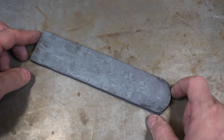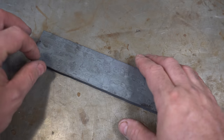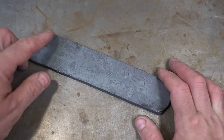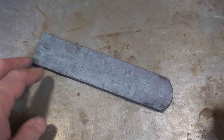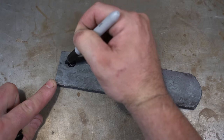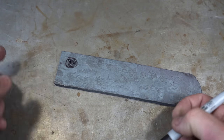Raindrop Damascus is another subtractive pattern, meaning we're going to be removing some of the steel from the billet so that when we repress it, the layers where it gets removed will get pressed up to the surface — or the other part pressed down, however you want to think about it — and that will expose the layers. We're going to be drilling some holes, and wherever we drill a hole you'll see these little concentric circles, which looks kind of cool.